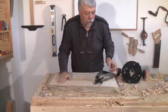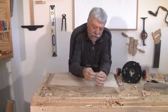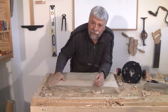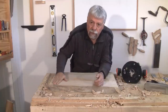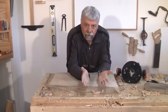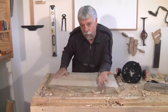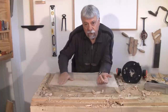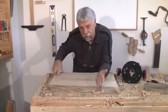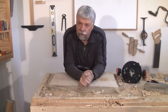Here's the board I've been working on. I've used one of my planes to make it flat, but with a hand plane you're really just taking off a thin sliver each time. It's about an inch and a half and I want to take it down to an inch or under — so there's a lot of wood to be hogged off. You could use a big belt sander, a larger planer, do it by hand, disassemble your jointer, or use an electric hand planer — but I didn't want to use that on this project.